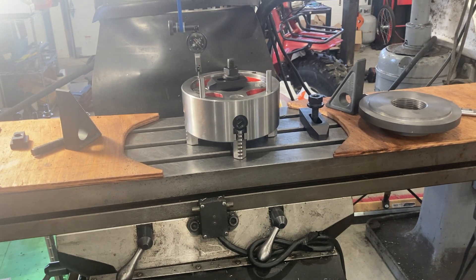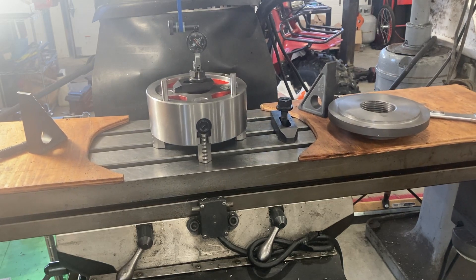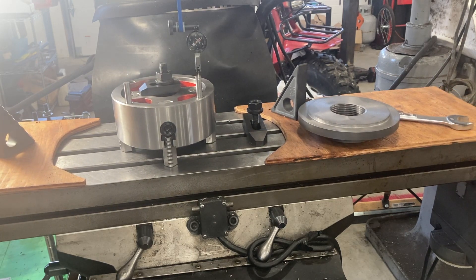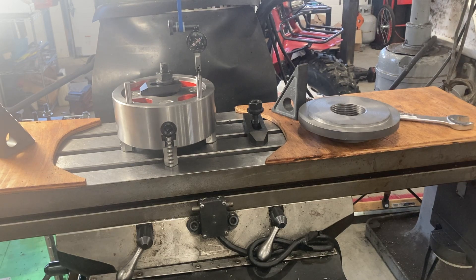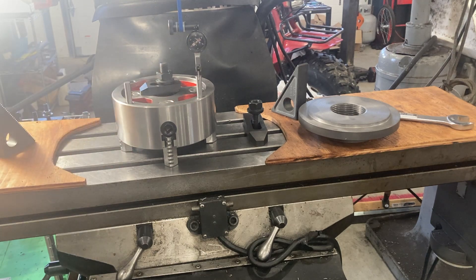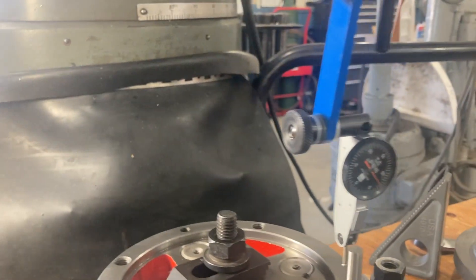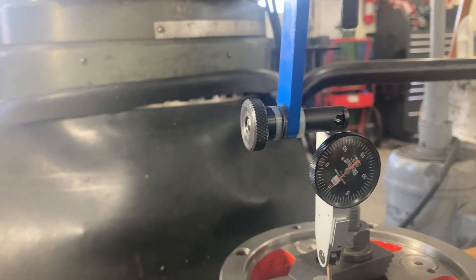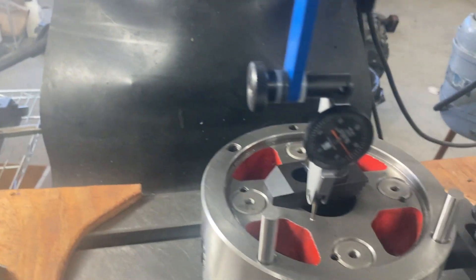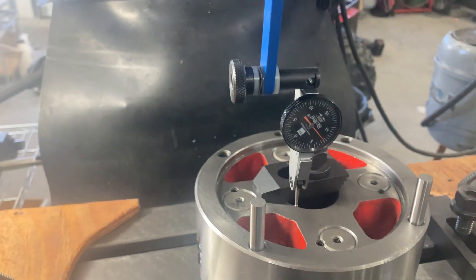As I go across, one pin comes up to zero, and then the other pin comes up to plus one half — because remember, this pin is one thousandth bigger, so you get plus half a thousandth on each side. So I got plus a half on one and zero on the other. That's created what I call the mirror image — the part is aligned so that these two holes are in alignment.